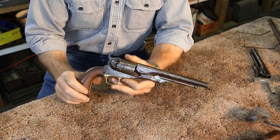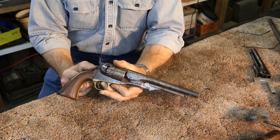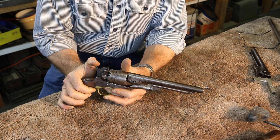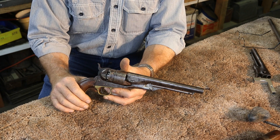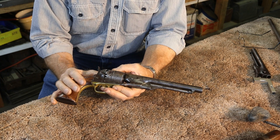Fortunately, all we needed from that parts gun was a mainspring. The mainspring in this one had been broken — who knows how long ago. Somebody had brazed it back together, and it really lost tension at about half cock, so if it was firing at all, it was just from inertia on that hammer. We had a little bit of an issue with timing, although it wasn't too hard to fix. The internals are close enough to single action army that it wasn't hard to get it timed up.